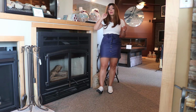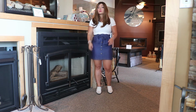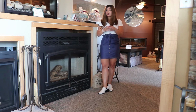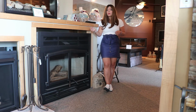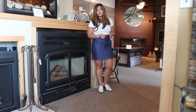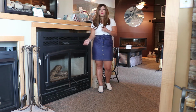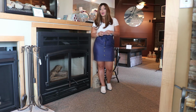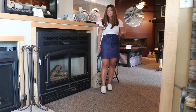Osburn does have a variety of heating options available on their fireplaces, including gravity kit options, which basically allows the heat to naturally rise and duct off the top of the fireplace. So if you had a bedroom located above the fireplace that you wanted to heat, that type of system will work without any type of electricity. It's all gravity fed. They do have forced air heating kits as well. Those are pretty cool options because they allow you to duct the heat off of the fireplace into another room and even like downwards into a basement up to 50 foot away from the fireplace. So nice variety of heating options.